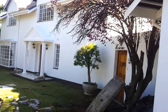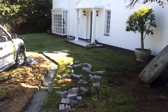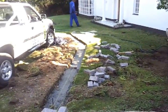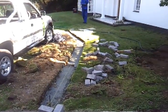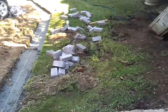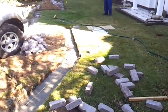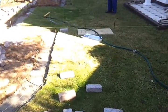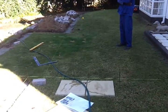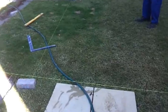Looking at this home, you can see everything about it screams for that sort of look and feel, and that's what the owners like as well. Initially they only had a lawn section at the top and then it slopes down quite considerably to the left hand side. What we decided to do is to retain it on the left hand side with a retaining wall, so that we can get the top level 100% level through here, leading up to where we're going to put a water feature as a central focal point with a pathway leading down the middle.